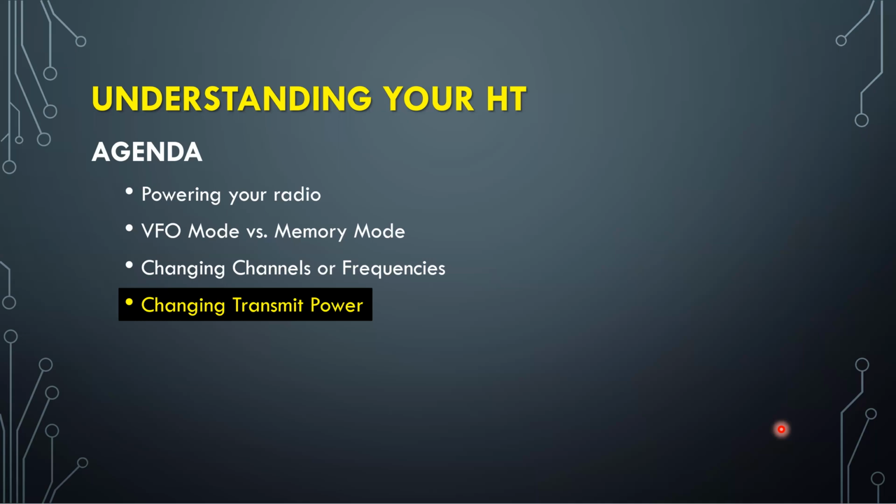And if I'm talking to Sherwood and he's across the street and I'm using 5 watts, I really shouldn't be doing that because I could also be affecting somebody who is 5 miles away because they can also hear me. If I'm using the VX-6, I should be using 300 milliwatts, you know, the lowest power, or 1 watt. Power low, whatever that is. Yes. That's assuming straight line between the two. What if you've got a mountain in between the two of them? That's called HF. Or actually, there's a lot of answers to that.